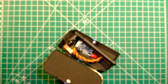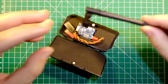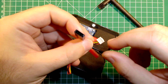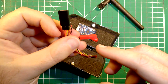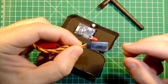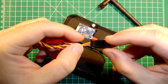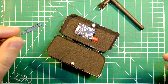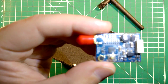Let's take a closer look at what else is in the box. It comes with a rubber ducky antenna, and a cable which plugs into the transmitter via a white connector. The red JST connector is for providing power, and on the servo connector you have the video input, plus red and brown wires providing 5 volts for your board cam.